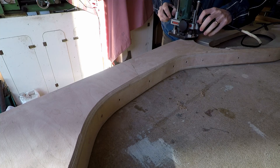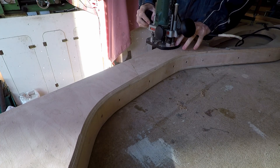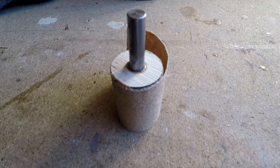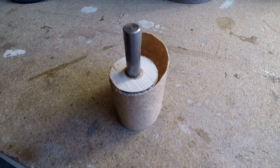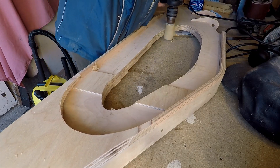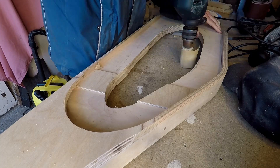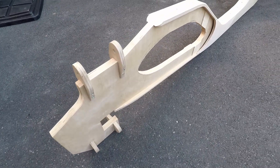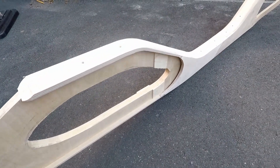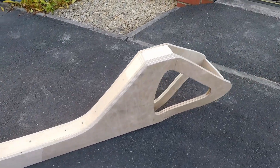The edges are chamfered pretty much all round on the body, so I'm using my router to provide that 45 degree bevel or chamfer. I made a little drum sander to go in the electric drill to sand smooth the inner surface of that cutout. And this is what the frame looks like at this point — a little bit of filling to do to fill up that gap, but coming together quite nicely.